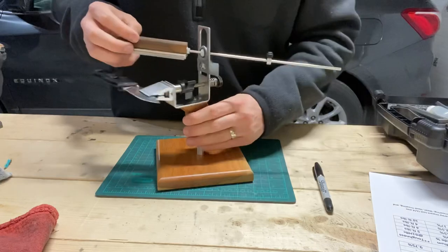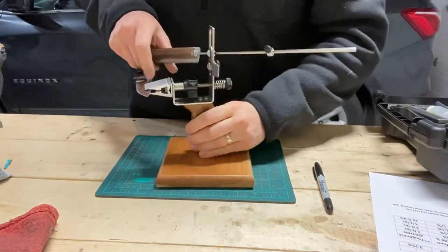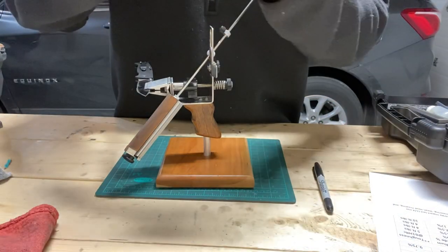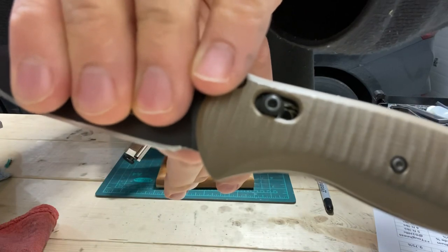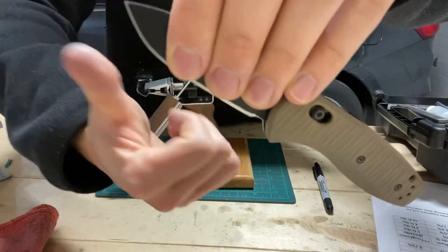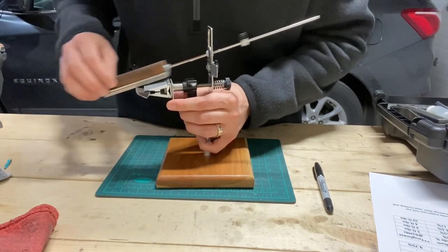Sometimes at the very back of the blades, the grind won't come down all the way, as it kind of swoops up towards the plunge and it gets thick. Usually if I see that, like here, this might be an example. Do you see how it swoops up there? That's partly just because I've sharpened it so far back, but sometimes I'll just extend the sharpening choil out towards the tip to kind of alleviate that. But there's other factors I usually consider other than that appearance, if I'm gonna extend the sharpening choil or not.